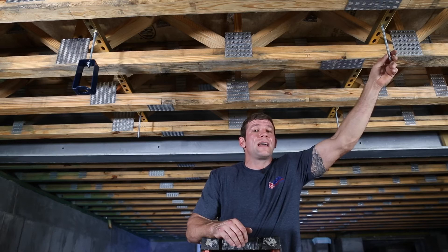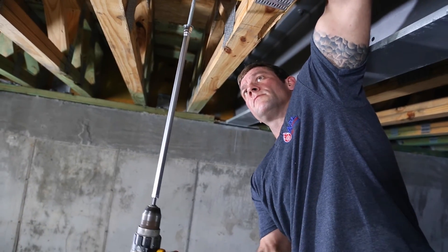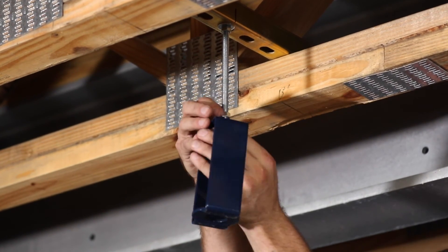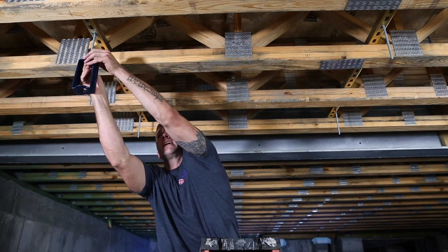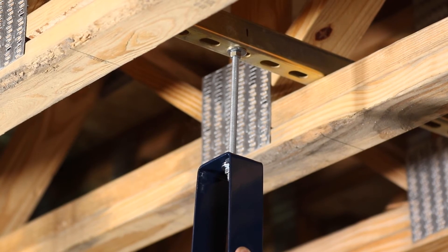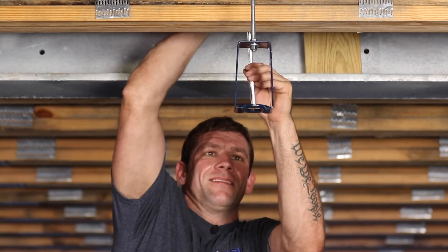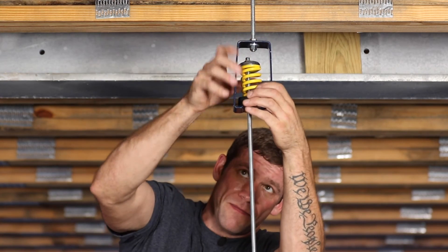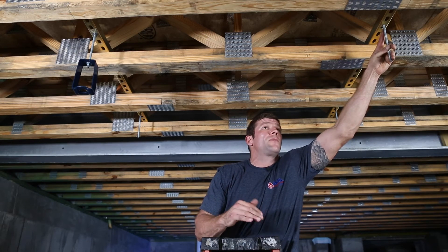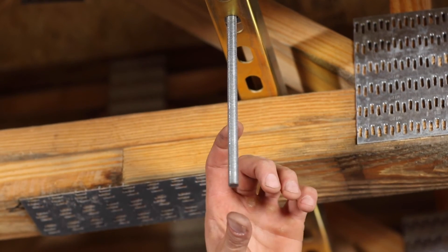If we were using threaded rod without a spring-loaded isolator, we would not have to put a washer and nut here, but since we are using an isolator, we're going to put a nut and a washer up here and a nut and washer at both sides of this vibration isolator as well. This is mostly for cosmetics — I can tighten these together to stop free-spinning, which means all my springs can face the same way. If we were doing a drywall application where there's going to be drywall on this ceiling, we would put a nut and a washer up here and stop for today, let the drywaller come in, drywall around this rod, and come back to hang our mechanical equipment later with our threaded rod already hanging down.